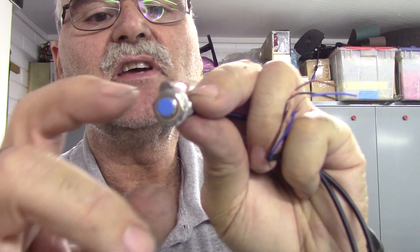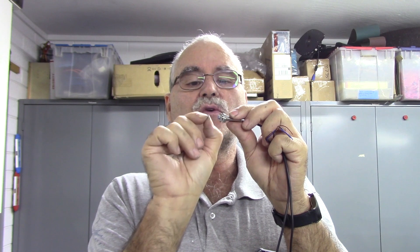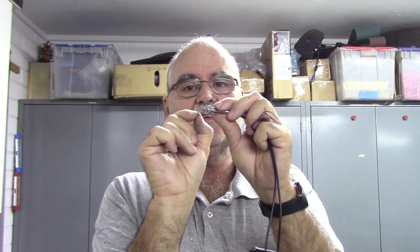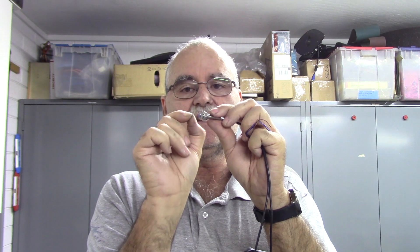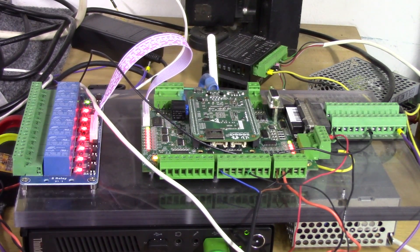The magnets for these sensors are very tiny neodymium magnets. You can just see it sticking right there. They have a north and a south pole, so one of the things we have to do is identify which pole is which and mark the face. We're going to do that by taking this Hall effect sensor wired to an Acorn board and find out which face will trip the sensor. If the magnet is embedded in the wrong orientation on the face of the pulley, the sensor can't see it and won't trip, so we have to make sure the pole is correct.